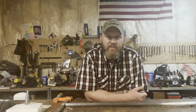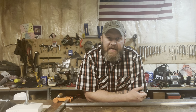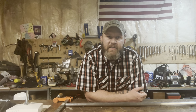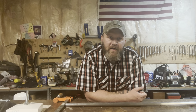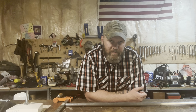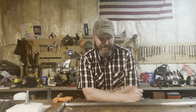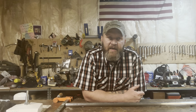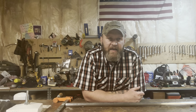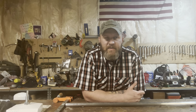Most of the time, if you're talking about professional level, you'll see people using dip tanks and they boil the barrel afterwards. Now I went through and tried to look into ordering dip tanks. They run about $150 on Brownells, there it is right there. Or you can have one made, and I called some sheet metal places around where I'm at and they all use galvanized, and if you heat galvanized metal it puts off a toxic fume, and these are all going to be heated, so I didn't want to do that.